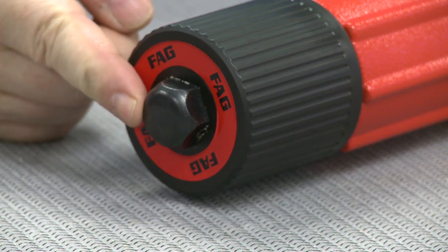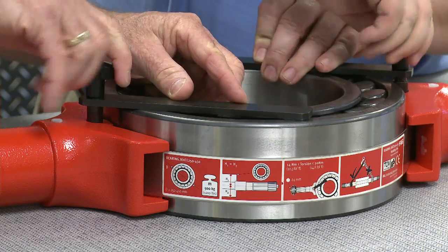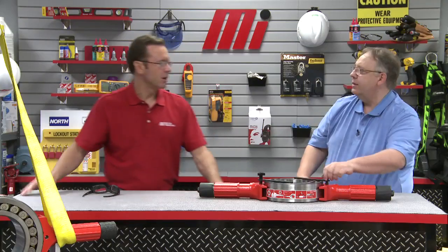At this point, you want to make sure that everything is tightened properly by torquing the bolts to 14 to 20 newton meters, which converts to 10.3 to 14.8 foot-pounds. Since this is a spherical bearing — and this would apply to a self-aligning bearing as well, which has a tendency to swivel — you want to make sure you install the included retaining brackets by inserting them in the provided holes, making sure you're in contact with the inner ring and not interfering with the bearing.